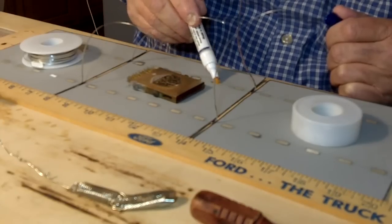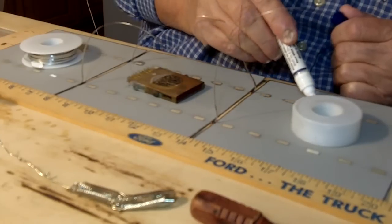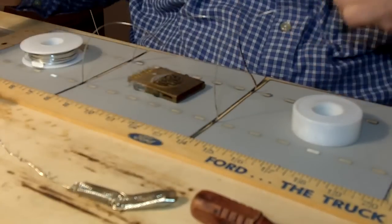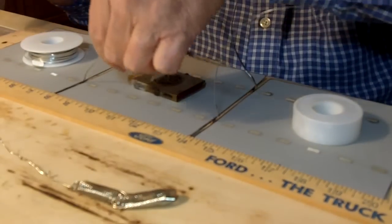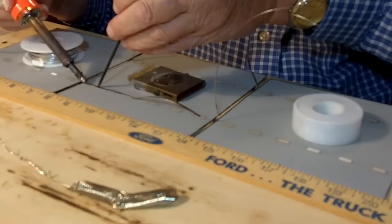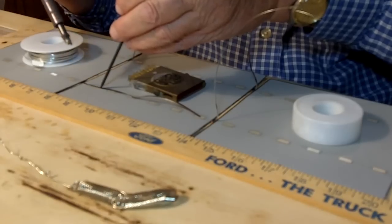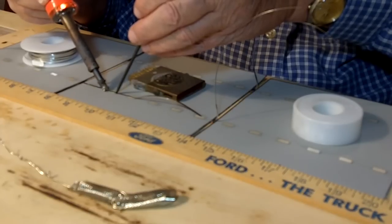When it's done it'll be in one nice long string, and I'll be putting three of these strings together to make a string of nine cells — four rows total. The next video will show how I actually assemble using the bus wire to connect the different rows together. One row will run one way, the next row will run the opposite direction, and the ends will be connected so you have one long continuous solar panel going from negative to positive.